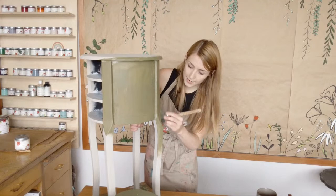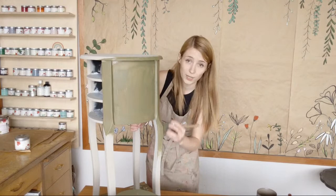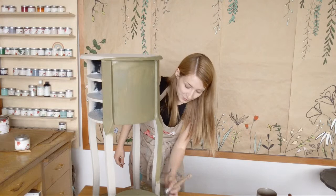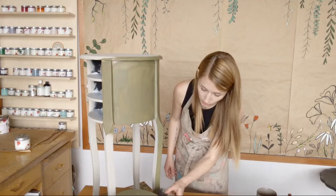I'm doing some cross-hatching, making sure I don't overwork the product. I've got the heat up in the house so it dries a little faster. If you're working in a cold shed, account for dry times. With distressing, especially with just two colors, you really don't want to work up the under layer, and you want to make sure this doesn't tack up on you either. For a nice, clean, natural distressed look, adhere to your dry times. 20 minutes is good for the wet distress method. If you're sanding with a sanding block or something, you can probably just wait a little longer.